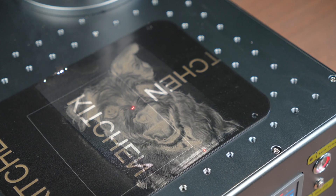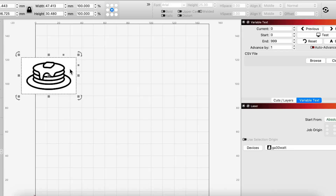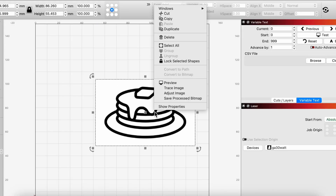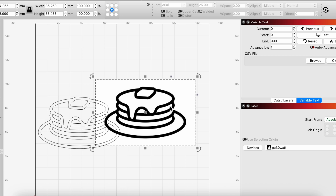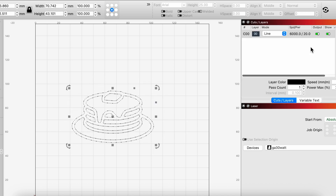The unit is fully compatible with LightBurn, and that's honestly one of the best parts about using this machine. If you spend any time in the laser or CNC world, you already know that LightBurn is kind of the gold standard. And now that they've rolled out support for fiber lasers, it opens up a ton of new functionalities that used to be limited to just diode and CO2 users. You can control power, speed, frequency, pulse width and layers independently.